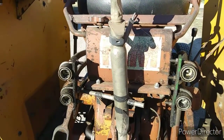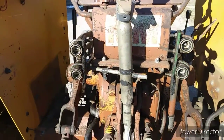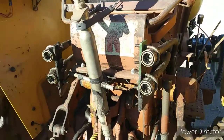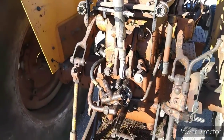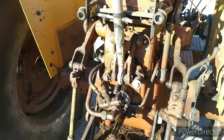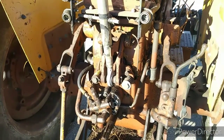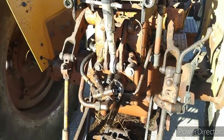The center three-point link is not original — that's the one I got with the tractor. Pioneer couplers. Hydraulics work well. PTO works well. It will spin when not being used and nothing is on it, but if you have your haybine on it, it will not spin. That's kind of typical for the Minneapolis Molines.